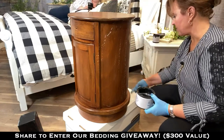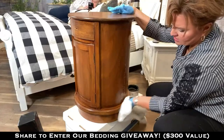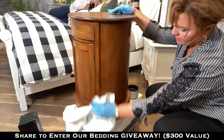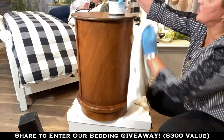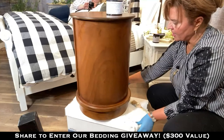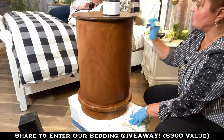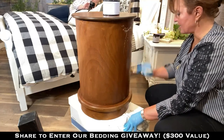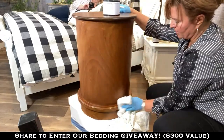You can look at it and go 'oh it looks really clean, I'll just paint right over that' — you can, but you may be painting over greases, oils, silicones, and sealers that make it shine. Those things are going to interfere with your bonding ability of any paint — not just this paint. If you're using a crud cutter or something like that, you definitely have to rinse it off, and if you don't, you're painting over a residue. We learned that the hard way — before we had our own deglosser we used to recommend all kinds of cleaners that leave behind a residue on the surface.